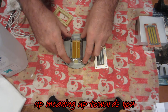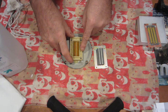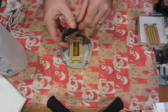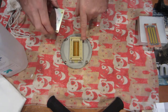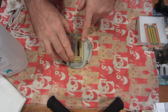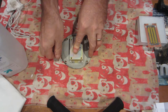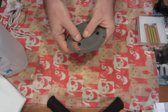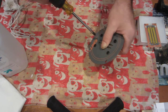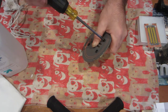Next is the actual new diaphragm. The lugs for the speaker wires go up. Then it's our block again with the small end going down, which sandwiches the actual diaphragm. Then with the small side down, you put this back piece in and that will prevent it from shifting back and forth. All the screws are in place because the magnet will want to lock into itself — it's actually opposing fields when straight up and down. So you slide that in and give it a push. With the two pieces sandwiched between your fingers, flip it over.